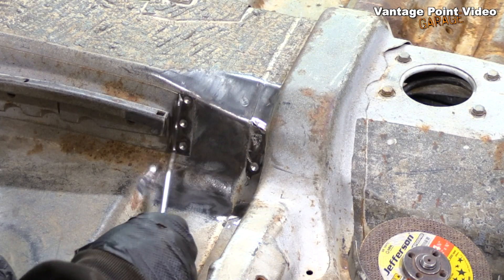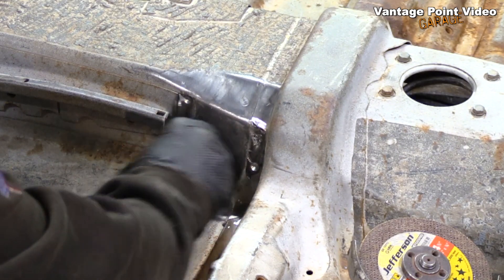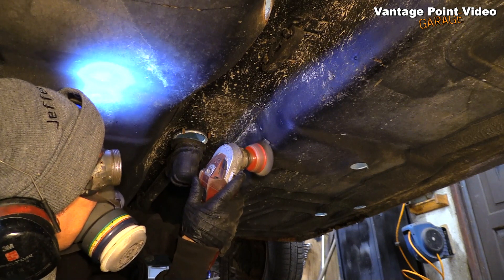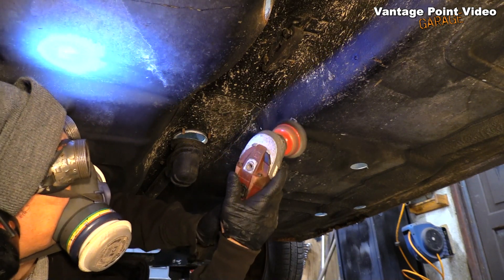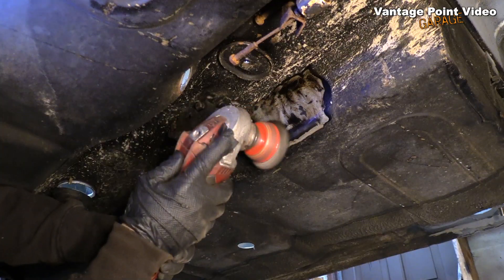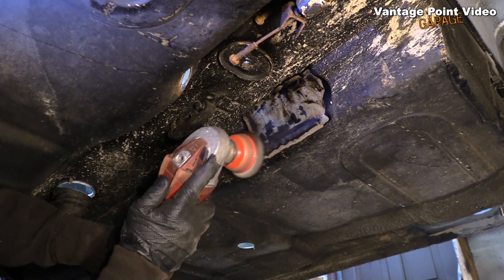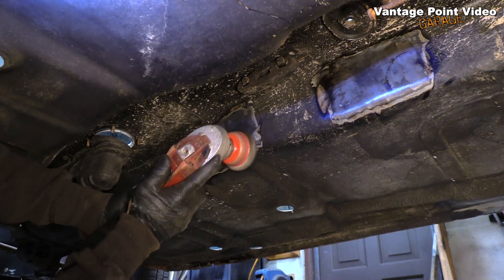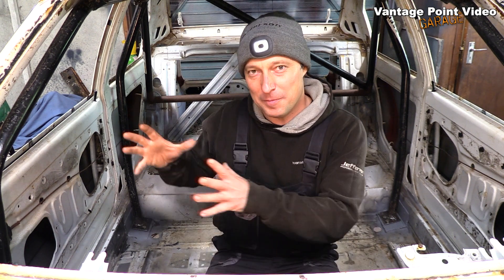After a little bit of a wiggle to get that off, the inside is prepped for welding in the brackets for the seat supports. For the co-driver side, I clean off underneath the floor so that the underseal doesn't catch fire when I'm welding in those plates.